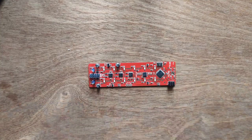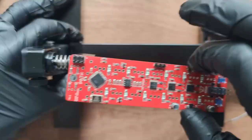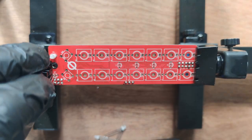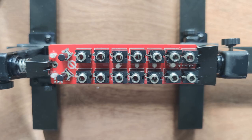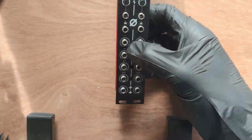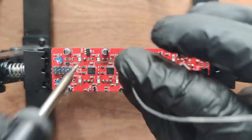Now it's time for the hand soldering. First, solder the 2x5 power header. Then the 2x3 pin header for programming the chip. Then solder a 1x3 pin header for the LED jumper. Now place — but don't solder yet — the six LEDs, making sure their orientation is aligned with the drawing on the board. Then 14 jacks, two buttons, and the caps, making sure to press each cap until it clicks. Screw in the spacer from the bottom side of the PCB. Now place the front panel, make sure all parts align with the holes, and place some nuts to keep the front panel in place. Then solder all of the front panel hardware.